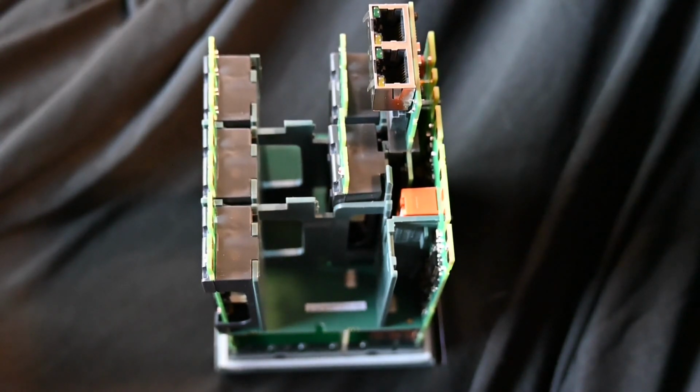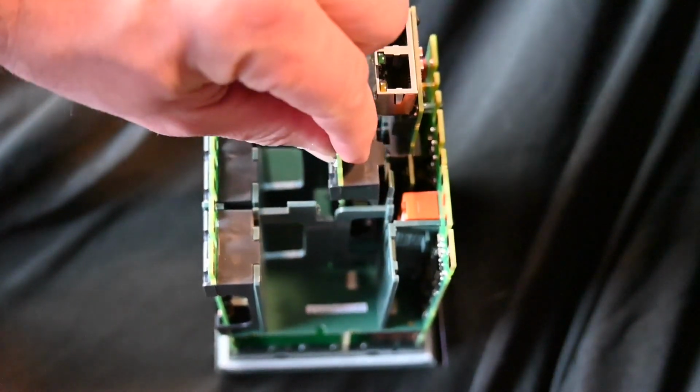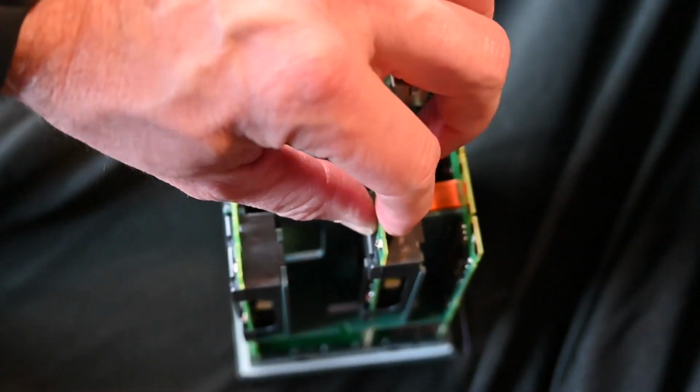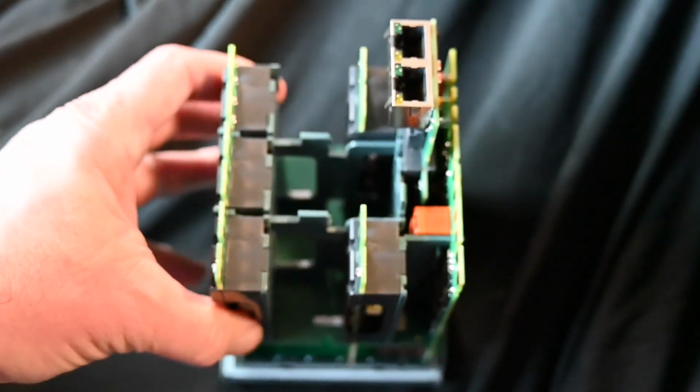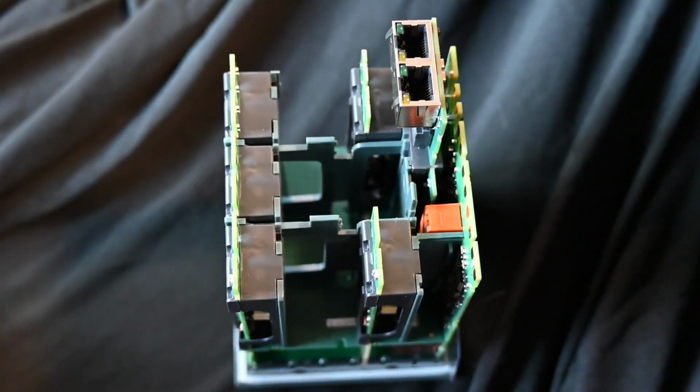When we got down into it, he had a module here, which I've already unplugged, and for whatever reason, he wanted to swap to a different position. So I'm going to snap this in real quick. So it's snapped in at a different position, and that's perfectly fine to do, but the controller, as a safety, kind of says, hey, I was expecting nothing in this slot, and now there's a board there. Did somebody really mean to do that?